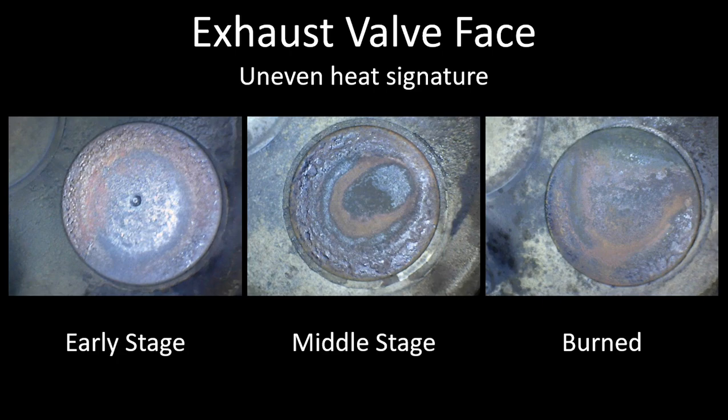If you have something like this bell-shaped curve, or a weird lump in the deposits with green in the center, then yeah, I would be concerned and you want to take corrective action. But it's not always uncomplicated to figure this out. The alternative that you could always do if you're unsure is to ground run it for a little while and then check it again and see how it's changed. Sometimes that will affect the color too.